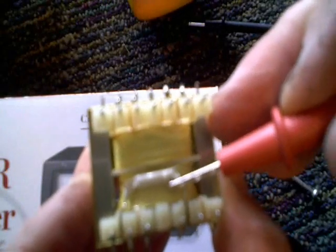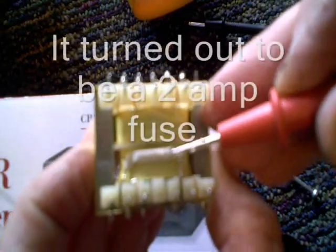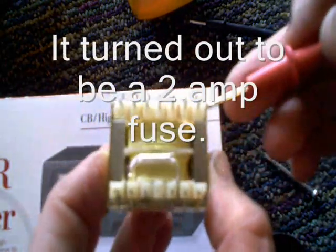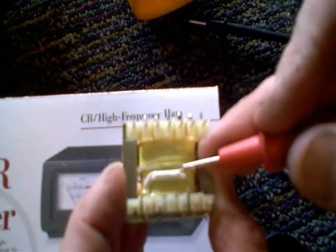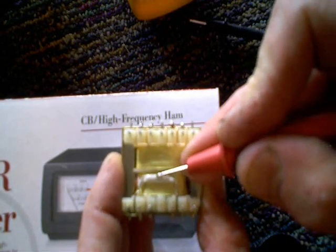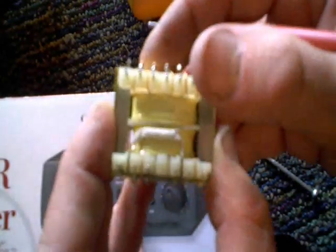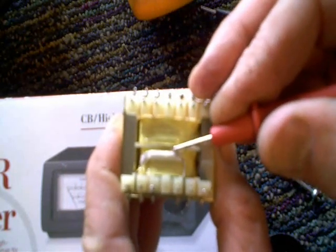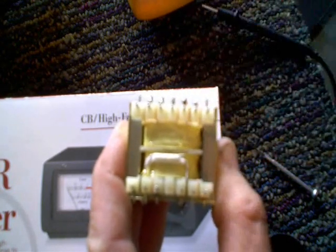Now it doesn't look like a fuse, but there's a fuse right there. It might have some more plastic around it — I'm going to see if I can further unwrap it and determine its value. I've seen this a lot of times, and you can't always assume it's going to be on the top of the transformer; sometimes it can be on the back side. Oftentimes it'll have the numbers on it, tell you exactly what it is. But even if you don't know the exact value of the fuse, you can sometimes guesstimate it just by knowing what it does and having a general idea of how much current is going to go through it.